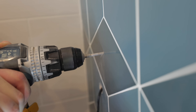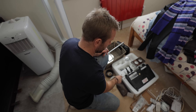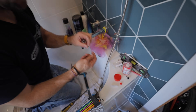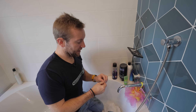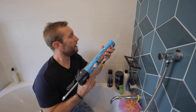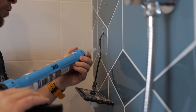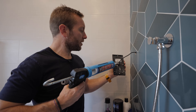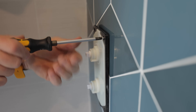Change of plan - normally I'd use big screws and go straight into the plywood, but the manufacturer supplied quite small screws, and those heads are going to recess nicely into those bits there. If I use my own screws with bigger heads, they won't recess properly. Before screwing anything up, just make sure you cover your holes with a little blob of silicone - your wall will thank you later, especially if water starts getting into these bits.